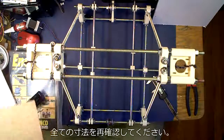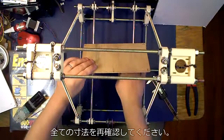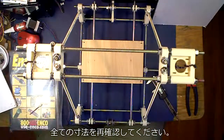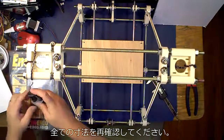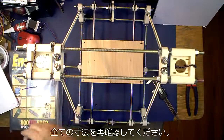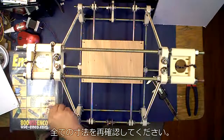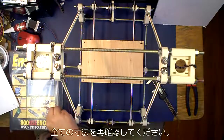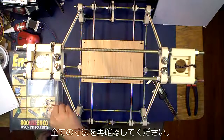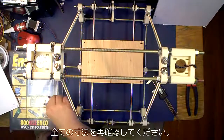Now what you're going to do is glue this board to your four bushings. Don't worry about the belt or the motor or anything at this point — you're going to do that in the next video. Most people use two-part epoxy. You'd prefer something that stays a little gooey just to make it stronger, so you don't want something that cures too hard. Be sure with your two-part epoxy to mix it really well, because if you don't it will never dry.